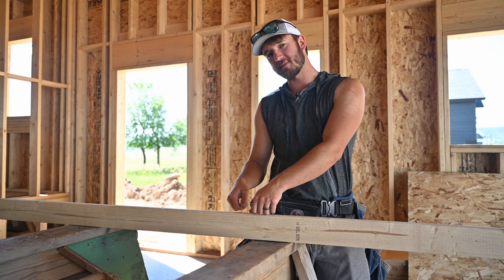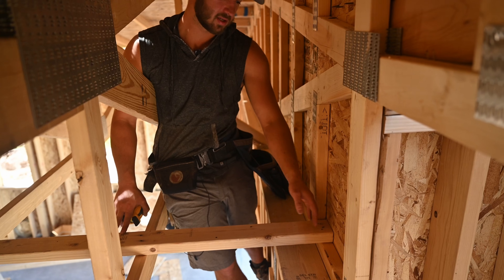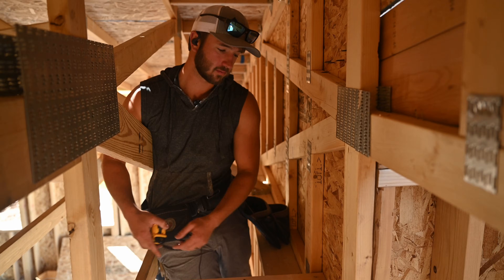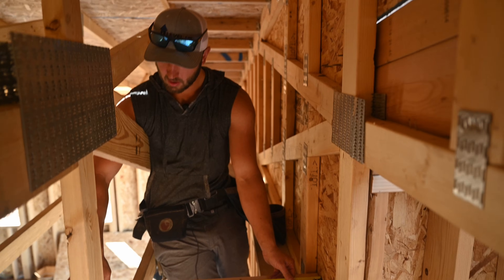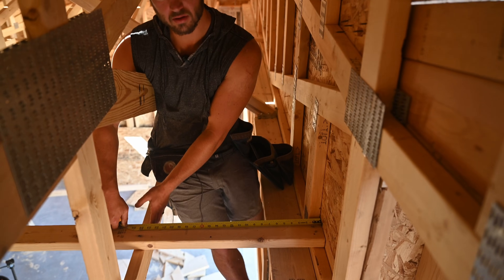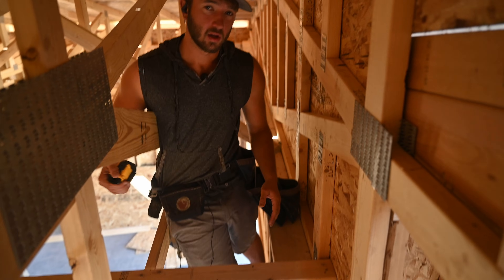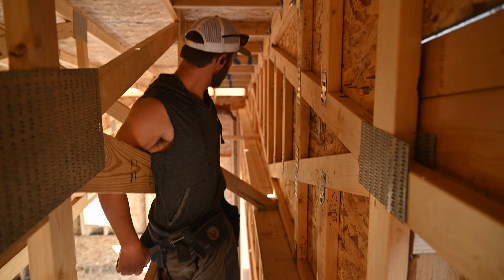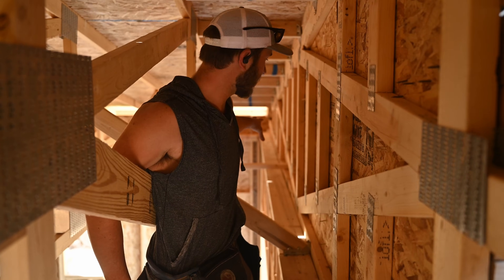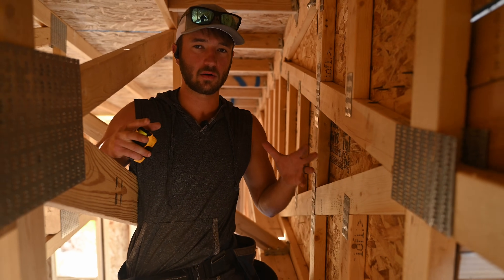Here's an example of the catwalk butting into the sheeting on the front of the gable. We have 23¼ to our mark here, and that's where we nail the truss. Then from there it's two foot on center. You can also see behind me, about 10 feet back, we have another catwalk. We do about every 10 feet so that the trusses stay on their spacing.